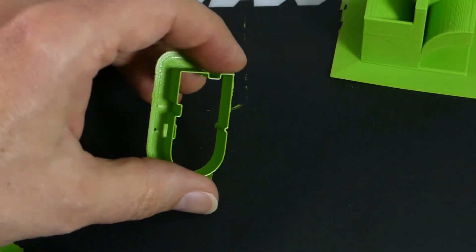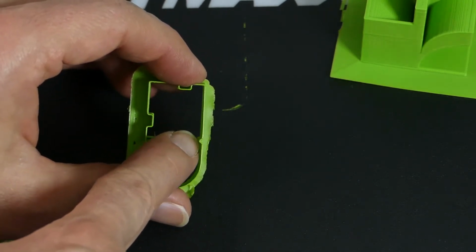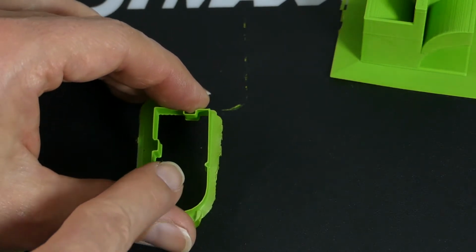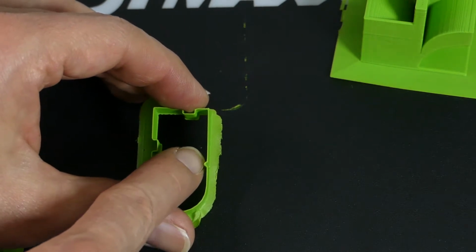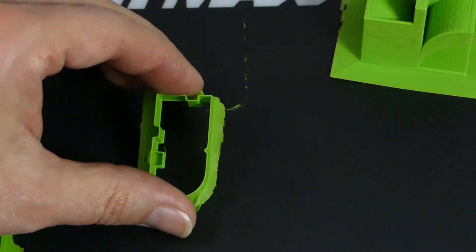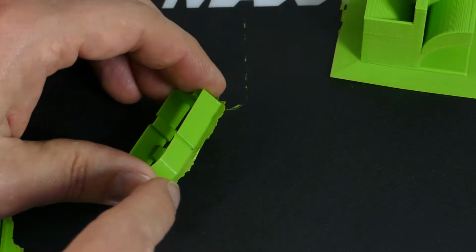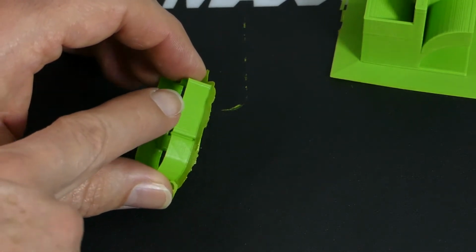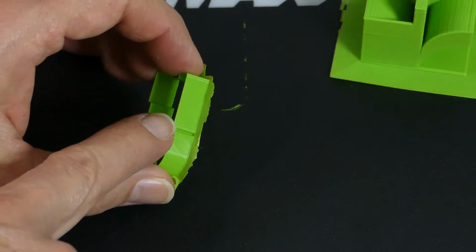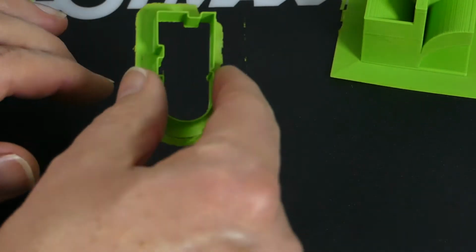The little notch over here is basically a movement that falls right around the jerk setting for the steppers. So this will actually be moved with just one step to the steppers. This would show if you have excessive ringing, and then you would have a pattern forming on this surface. This is present on the printer, but it is very, very minute. So first test passed.